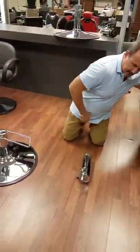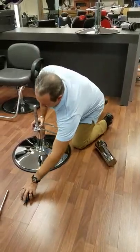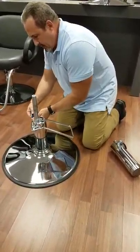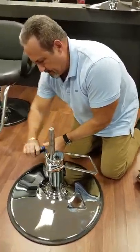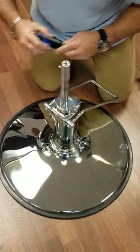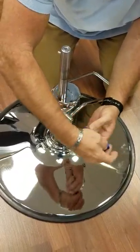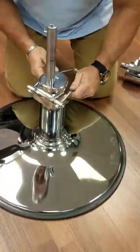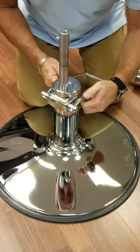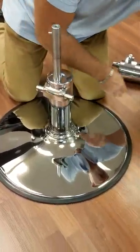So I set this aside. We have our new cylinder — it comes in just like this. You need a metric Allen wrench. The screws that hold the treadle in are four millimeter. You're going to unscrew these set screws. The treadle will work its way out — set it aside, you're going to need that.